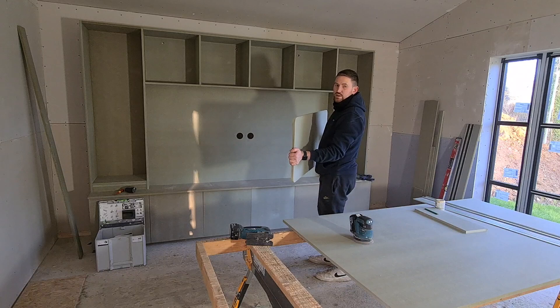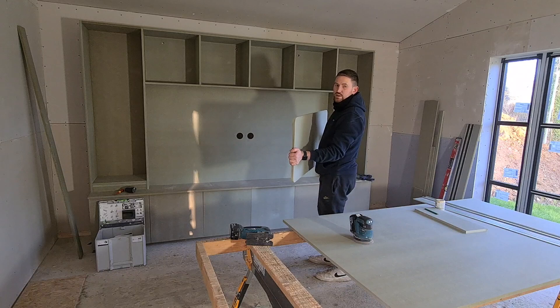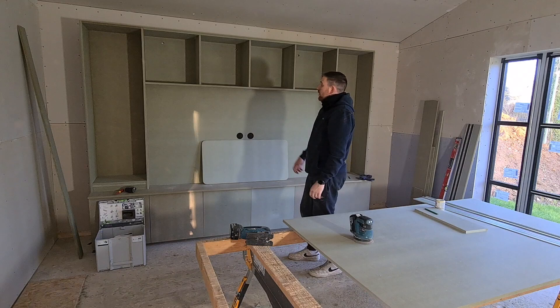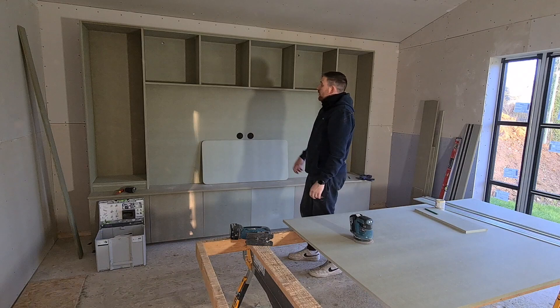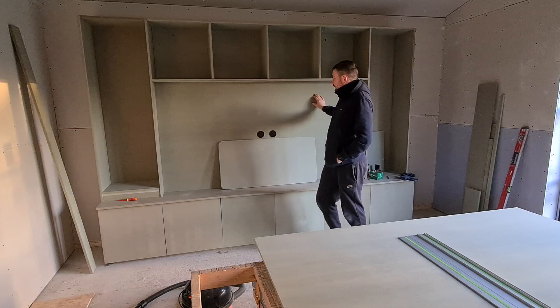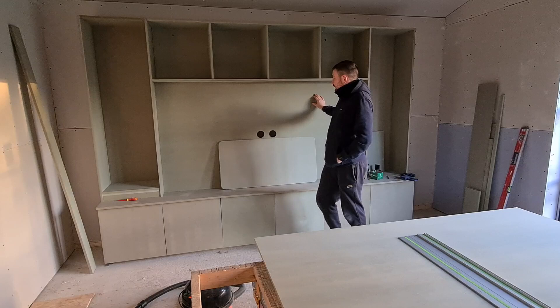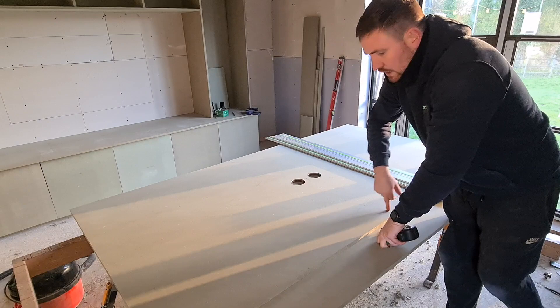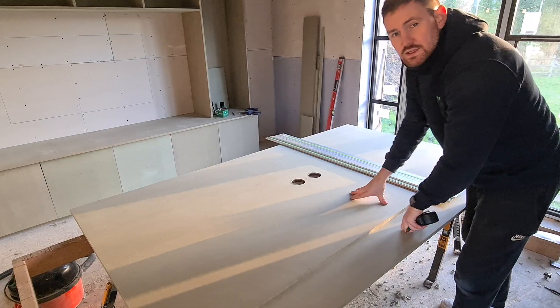So we can just go around this edge with a nice fine sandpaper, finish it all off, and make sure all of the cuts are level because jigsaws can sometimes put a little chamfer on the cut. So that's our backboard done — that fits on this one, your telly goes on front of that, and your lights just stick around this rebate here. All we've got to do next is put the vertical V-grooves on this backboard and make the doors look like shaker doors. We've marked our two centre points and you always want to start from the centre and work off to the sides, then measure our 100mm sections away from that centre point all the way to the edges.